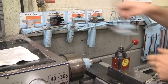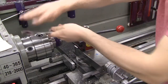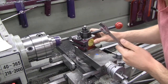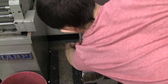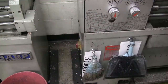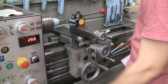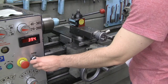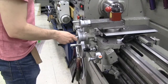Now you will use the turning tool to face off the front surface. You want the tool leading edge at an angle to the stock material so the leading edge will do all your cutting. Do your best to align the leading edge with the center axis of the work. Turn the switch to power on the lathe, then pull the lever up and out to turn the lathe on. Adjust the speed to 400-500 rpm for facing the steel surface. Put some cutting fluid on the work and face the surface.